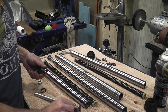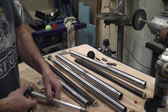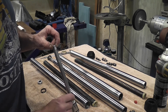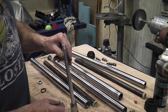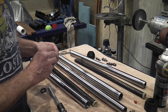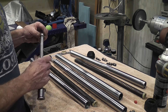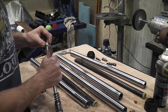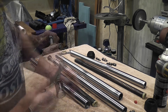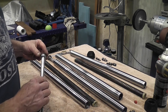The order in which this goes together: put your circlip on, then this spacer with the recessed end away from the circlip. That recess is where this nylon washer sits. And you've got the washer with the holes in it, then the spring. This end here is threaded - I'm just putting some Loctite in here. Screw this on all the way. Now that there's no hard Loctite in there, it goes on fairly easy. Now the little oil ring.